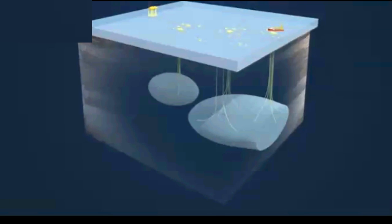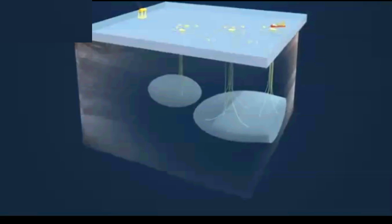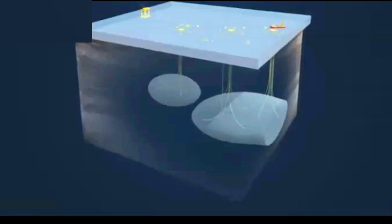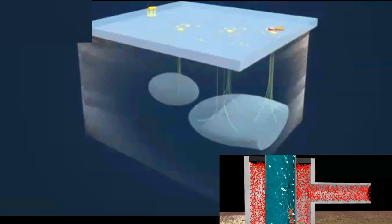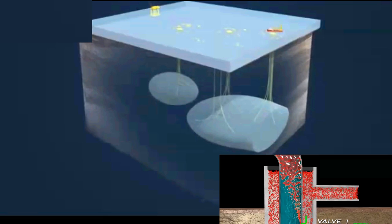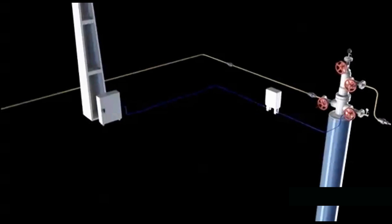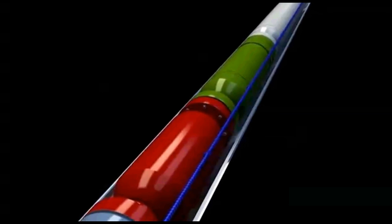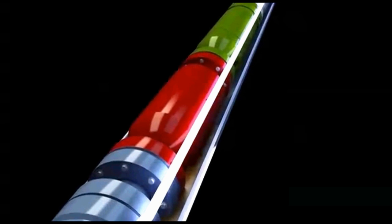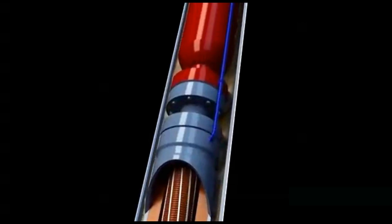Gas lift, on the other hand, is generally used offshore where the sucker rod pumping system is not suitable. It can also be used in wells that are deeper than those that can be serviced by the sucker rod pumping system. Because of its need for repeated maintenance and its dependence on a source of injectable gas, however, gas lift is the second choice for artificial lift. Finally, the electric submersible pump is reserved for wells either onshore or offshore with high production rates that can justify its relatively higher cost. Like gas lift, it can also be used in deep wells.